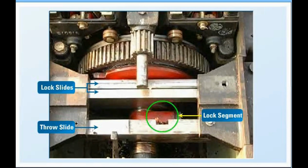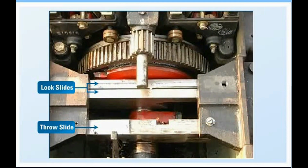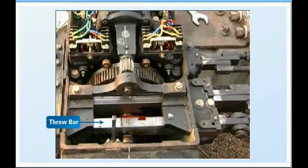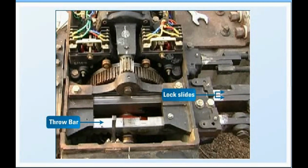Motor rotation continues further after operating of detection contacts. Locking segment starts to move out of locking notches. Normal detection notch of control disc will now be shifted from its normal position and roller A will rest on both lift out disc as well as control disc periphery. Roller B moves out of the normal notch because the detection slide locking segment is out of locking notches.